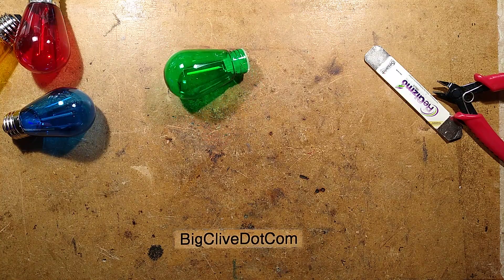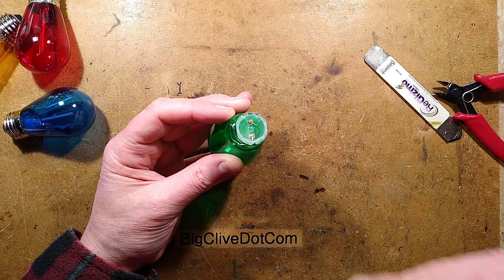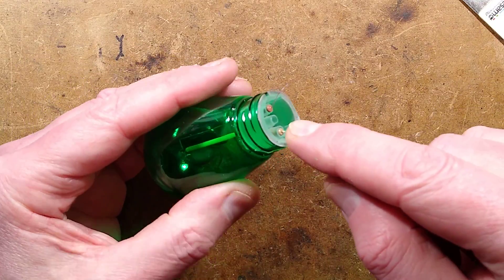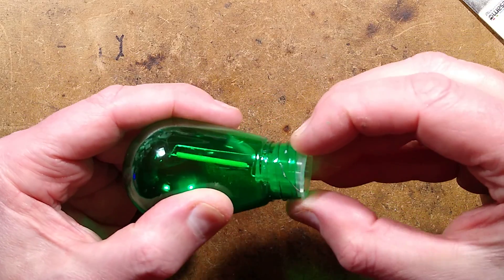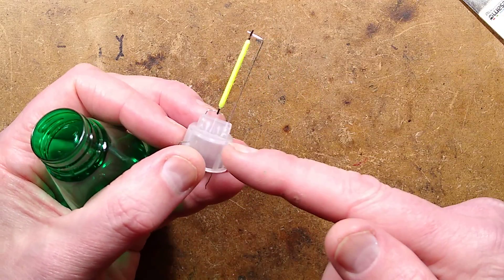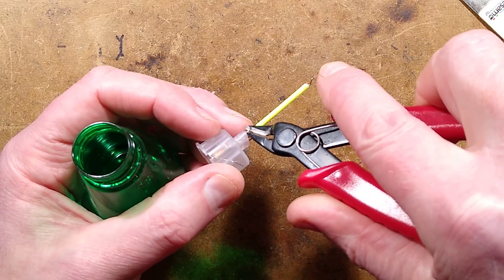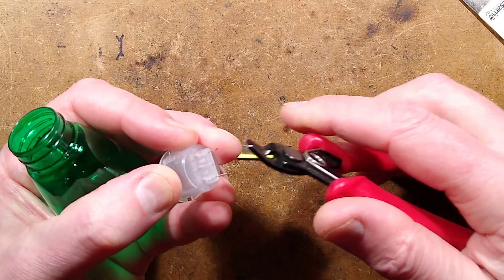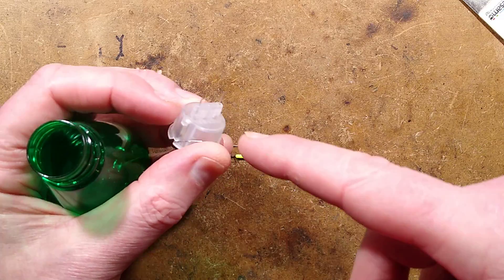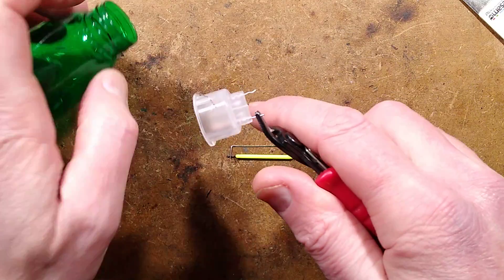Here is what's inside the lamp. There are two wires coming off the bottom with what looks suspiciously like resistors - largely because they are resistors. This one I think is a 15K resistor, and this one is an odd resistor that just doesn't have any specific value on it. The filament supports here are actually the leads of the resistors, which is very odd. I'll cut these and strip the resistors out to replace them with other ones. They've been locked in by basically just fusing them from the side using heated pins to mould the plastic.